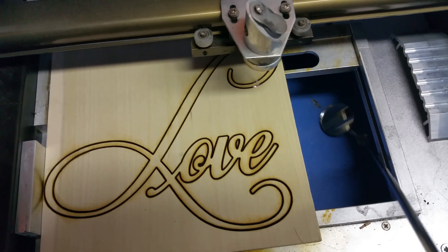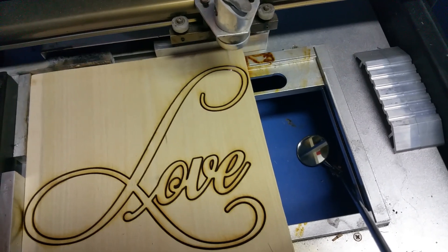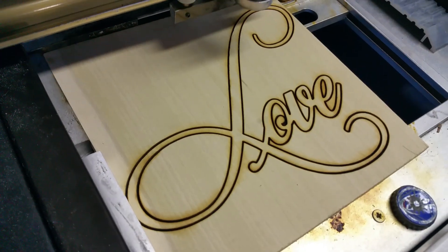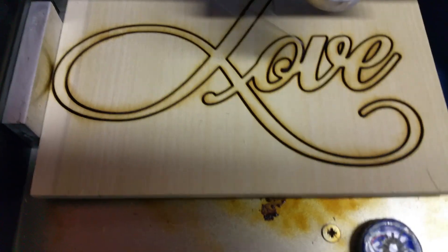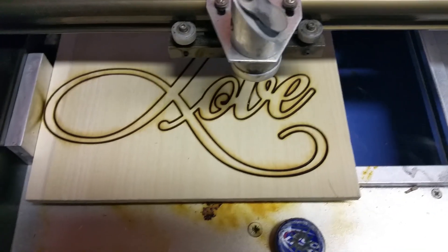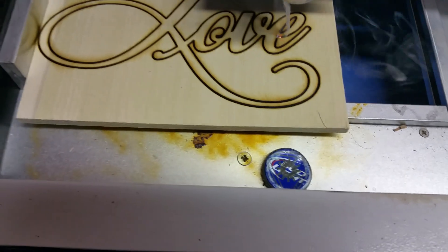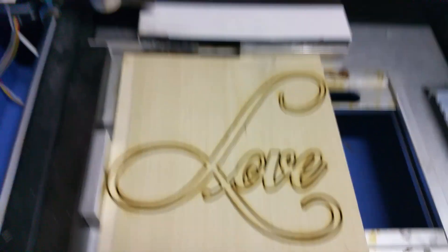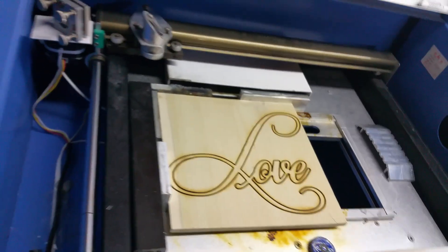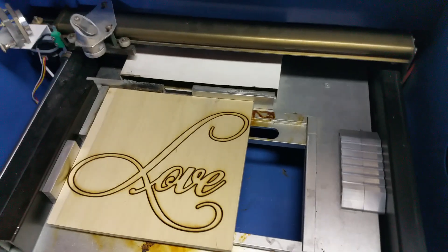Right there — we're making it through. It's kind of hard to see because it's over the metal, but we're making it through. When it comes down the line you can barely see it because it's either making it all the way through or that crack is so deep — we're dealing with six millimeter poplar — that you can't see the light of the laser. Okay, there it went off. I've done a total of six passes and moved the laser up.